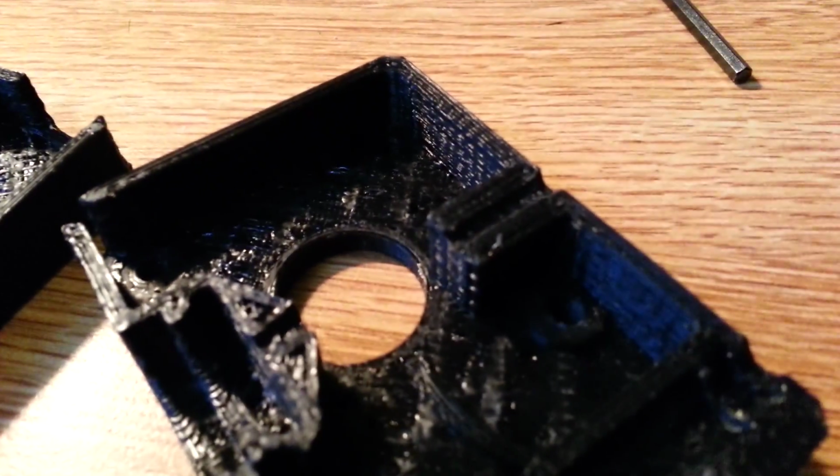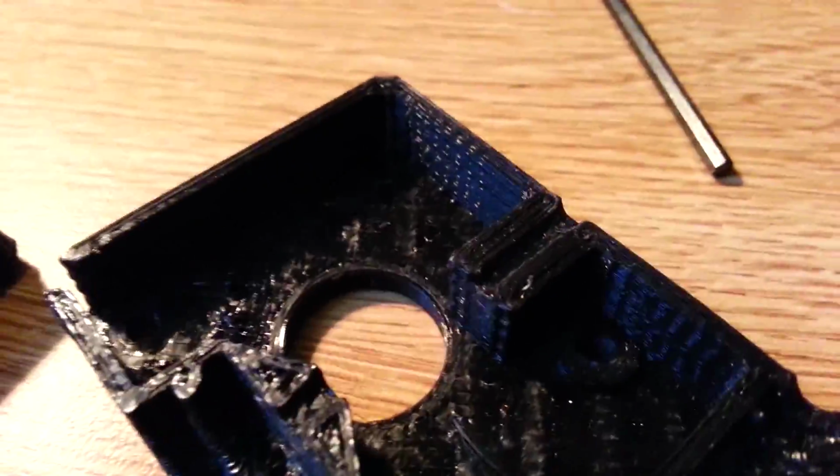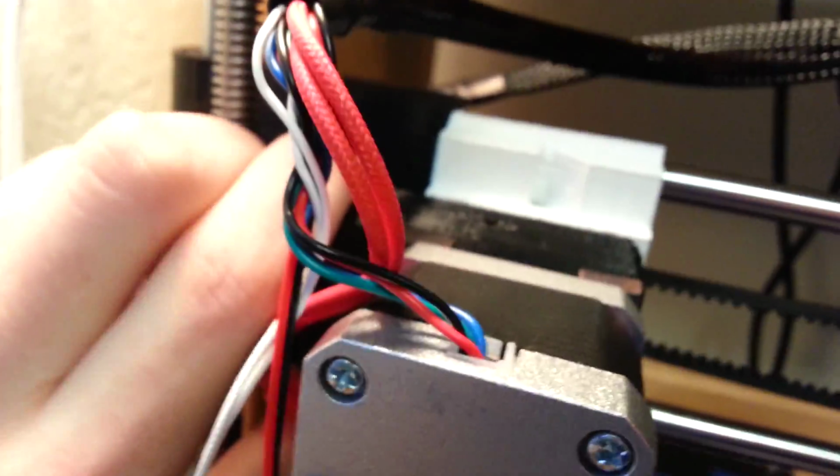Now also, it has grooves. I'm going to go over here. This is the old version, but it's essentially the same. It's not a big update. It has grooves on the top here, and then on the bottom guiding into the hot end. What that does is it makes it much easier to load the filament, in conjunction with a lever right underneath here that you can just squeeze quite easily. It's nice and out of the way, so it doesn't look ugly. Although, I mean, the screw's kind of technically ugly, but whatever. But you can kind of just pinch this whole side and it will release pretty easily.